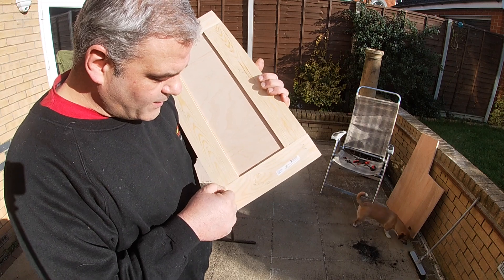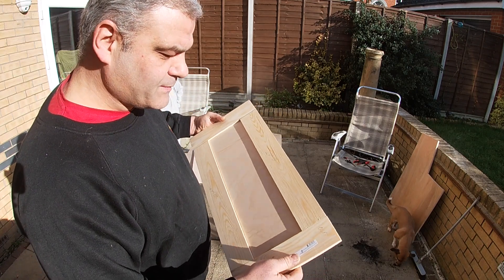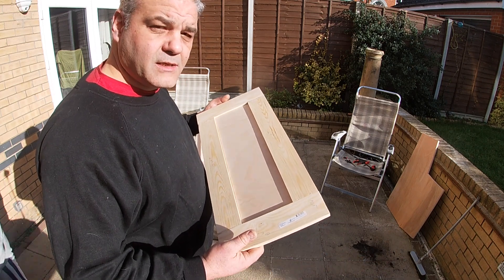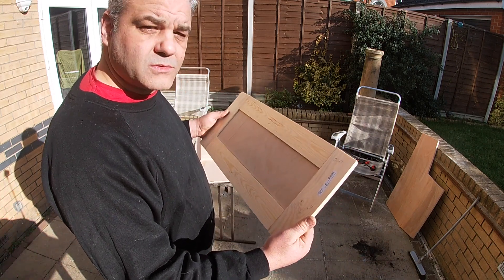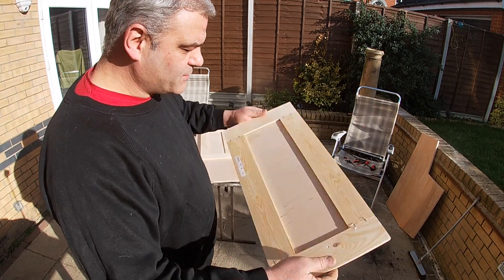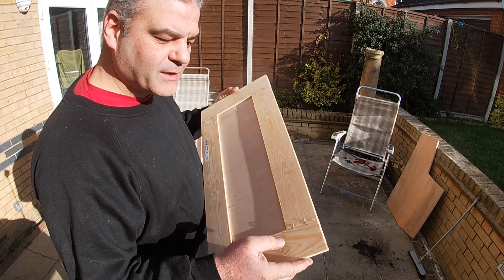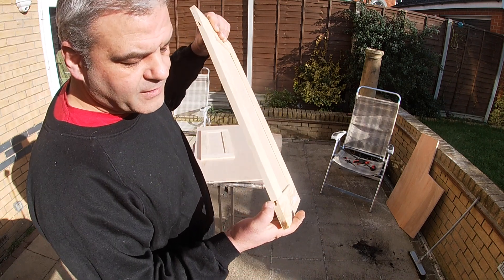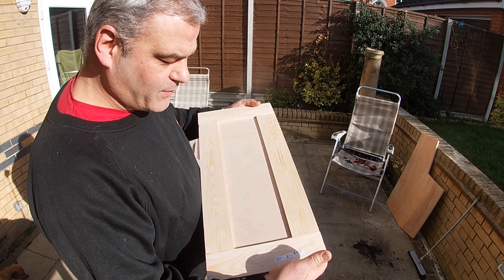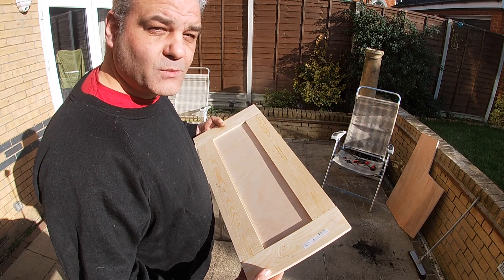I want to try and get that line back in there, so I'll have to sand a line in there at the filler just so it ties in. What I'm going to do is weigh these compared to a bought door and see what the difference is in weight, because that's nice and light. But it's still strong and does its job. At the moment I've left the staples in. Before I paint it I'll pop them out so it really gives it a chance to cure off. I've got to do a bit of filler in these holes as well.